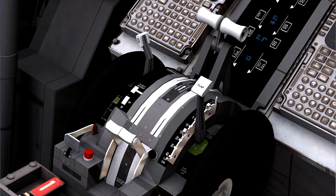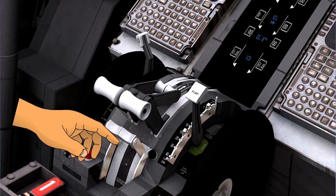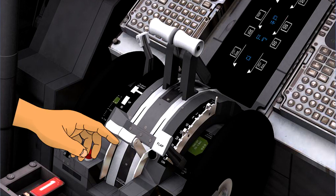In a typical system, if the flaps are at an intermediate position with the gear not locked down and one or more of the throttles are retarded, the warning will sound. The isolation switch can be used to silence the warning. If, however, the landing flap is selected with the gear not locked down, then again the warning will sound, but operation of the isolation switch will not silence it.